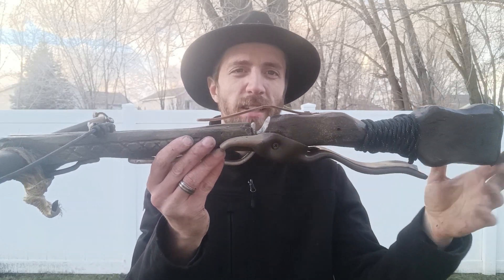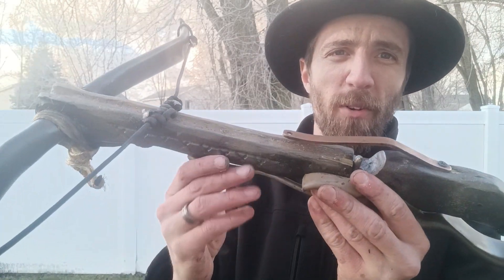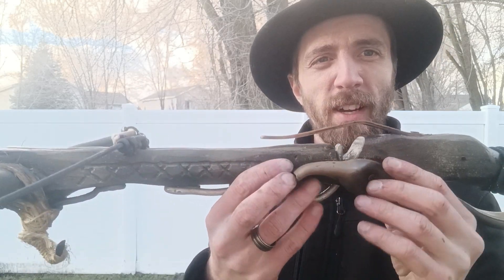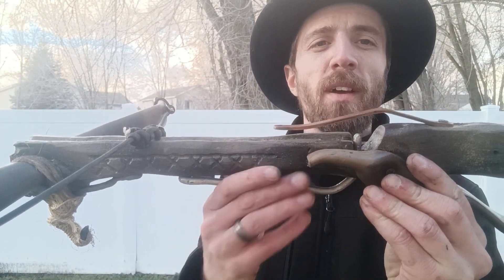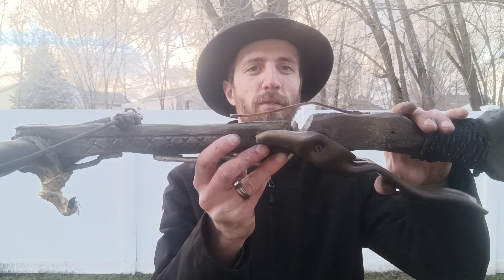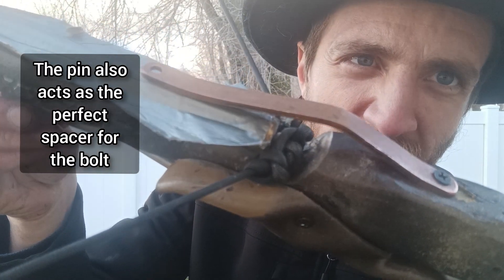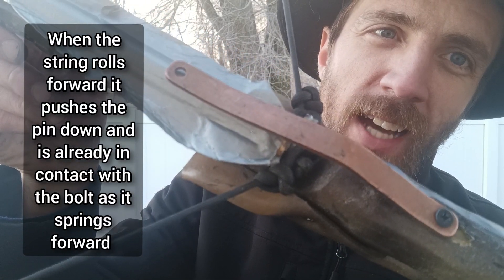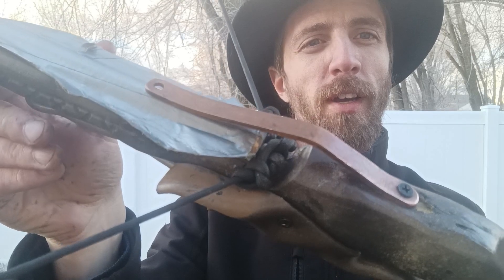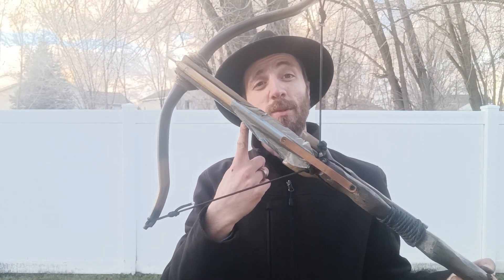So here's our finished trigger, built-in retainer lug made, all that jazz. I actually replaced the lug we had in here — you can see it tore out right there, it actually blew out because I upped the power just a tiny bit, maybe to 80 pounds on this. It blew that plastic shelf right off, so I changed it out with kind of a spring-loaded aluminum one that's going to allow the string to knock back on there, but also as the string flips up it'll push it out of the way so it has a straight shot to take the arrow off the shelf. So with a bolt in there, you can see that steel pin is stopping our bolt from contacting the string. As I press on that trigger to release the string, it'll roll forward, drop that pin out of the way, and pull the bolt out, allowing it to fly perfectly straight. Let's get a couple of test shots done so you guys can see how it functions with the trigger.